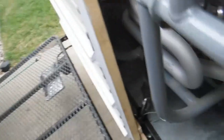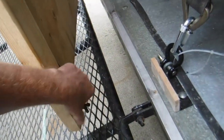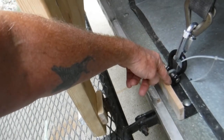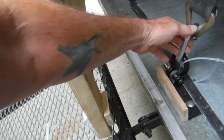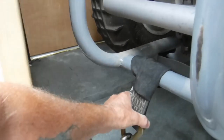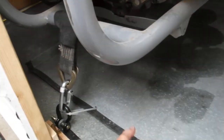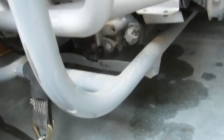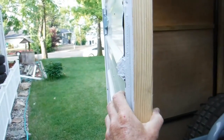On the bottom I used a cross bolt — again, something that I had. I put a piece of angle on the floor and used a piece of cedar I had bought as a stop. I've got this forged eyelet that goes underneath the bottom of the trailer through a piece of steel that is welded to the main frame, so this is pretty secure. This strap came with the buggy when I got it. All Volkswagens in my opinion, if they don't leak they will leak — but this is about the door. I made the door out of 3/8 plywood, caulked it, put the foam in, and tried to seal these doors up.